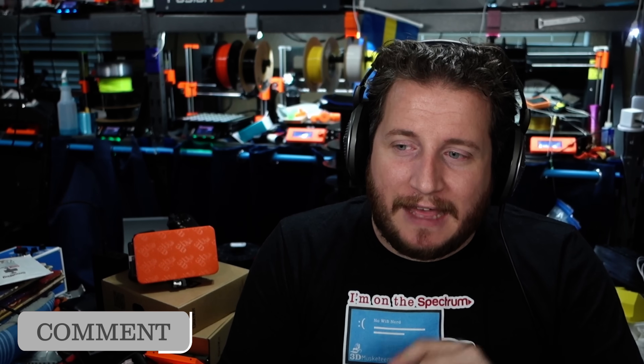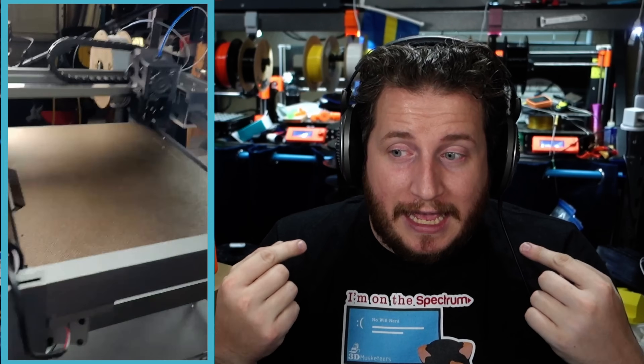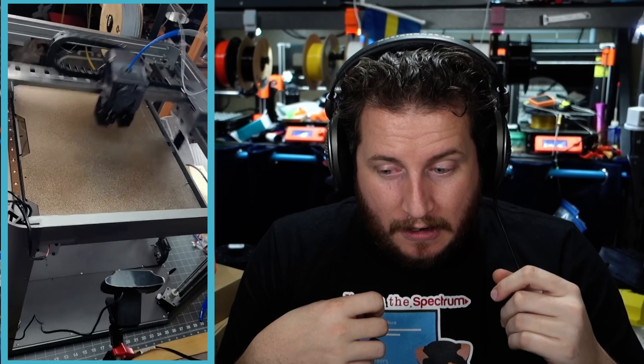This is why we talk about making sure your machines are maintained. Just find loose things and make them less loose — it's not that difficult. But it can add up to problems over and over again if you don't regularly check, especially on printers with V-wheels, that the V-wheels are reasonably tight. We did an entire video on this — we'll card to it so you can take a look. Have you ever seen a machine get this bad? It was wobbling so much it looked like oobleck on a subwoofer.